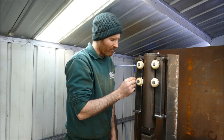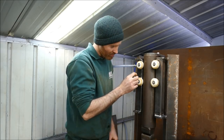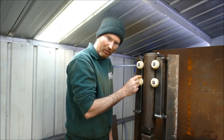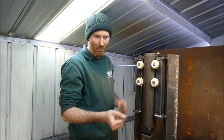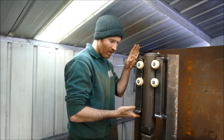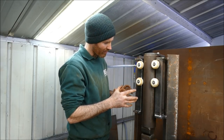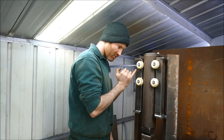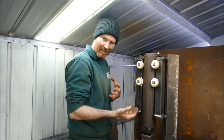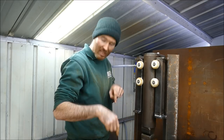It still isn't perfect, like what I did with the spring washers very lastly, that isn't the ideal solution. In fact, what I would recommend is there's an actual boss, which is basically a lug of steel that you weld onto your posts and then drill and tap all the way through that. That would be better, and I'm going to put those on the drawings, because the drawings that you have for your power hammer are very slightly different to mine. I modified it so you get a bit more space and all this kind of thing. So the distance that I've got between the post and the bearing might be slightly different, but I'm going to go through the CAD drawing, make those amendments, and then you'll have that available for download in the description.